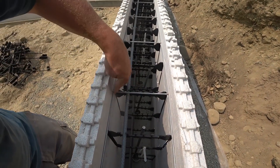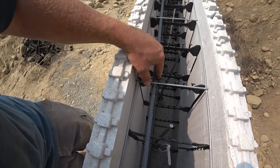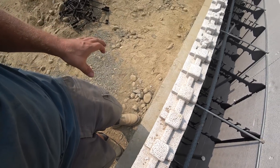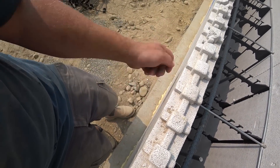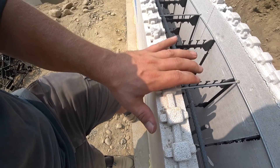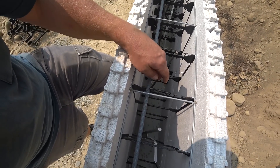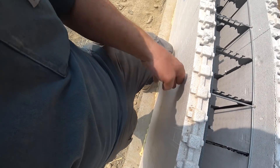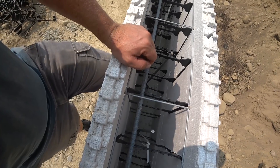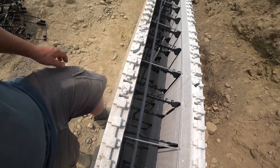After thinking about it, I realized the wall basically has to be assembled before you can even start installing these braces. According to the instructions, we need to poke a wire through the wall, wrap it around the in-wall bracing and the cross ties — and I'm going to assume the rebar too, since that's part of the structure of the wall. Poke it back through the wall and have these pigtails sticking out. We'll put our brace across and wire tie that to the wall, which means we can both push and pull on the wall. You're not supposed to pull — at worst you want to push. But the reality is if your wall is bowed out, you're going to have to find a way to bring it back to true. So I'm realizing the wire tie portion going through here has to be done after the rebar is in and after the in-wall bracing is in — and of course that can't be done until the wall is built.